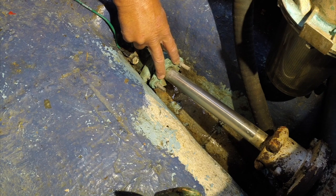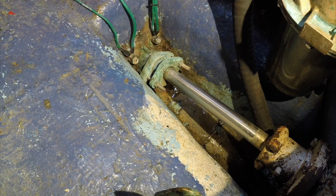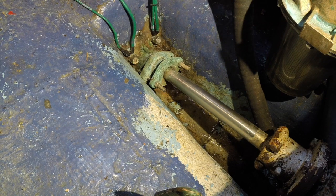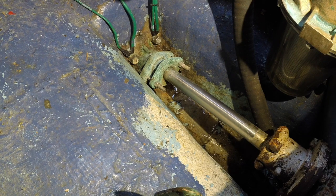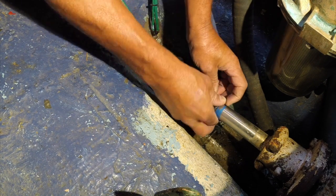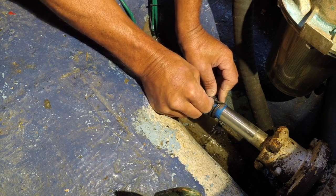So this is our packing nut and stuffing box right here. These two nuts shove this collar down and the stuffing is located inside here. What I need to do is wrap the GFO around the propeller shaft and cut several little rings, making sure they're cut on the angle so that when they tighten against the shaft they wedge down and close the gap — sort of like a scarf joint in woodworking. Before I wrap them around the propeller shaft, I'm going to add a little masking tape to increase the diameter so the pieces will be a little bigger and wedge down and pack in real nice. I'm cutting it at a 45-degree angle — it's going to be a neat trick.